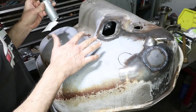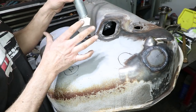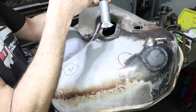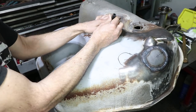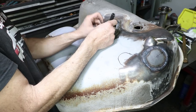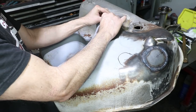Okay, this tank has been flipped over, and normally the fuel pump, like I showed last week, would be attached to the bracket. Now that bracket happens to be away being zinc plated at the moment, so I have to do without it. But the bracket supports the fuel pump. This goes inside the hole, and then it's going to go down inside the box that is the baffle box with the check valves, and then there'll be a right angle fitting on this hose with a swivel AN fitting to it, so it'll drop down in. This will turn to here, and then you will tighten this down.